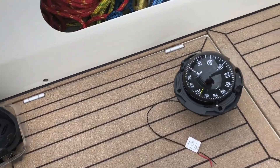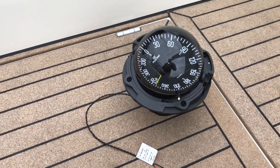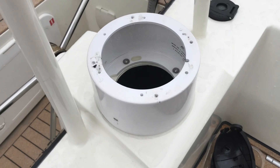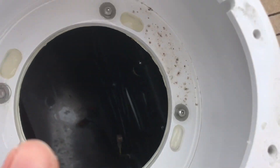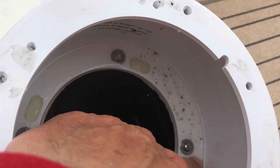I've taken the compass out because it's been a source of leaking. There are all the various bits and pieces, and here's the binnacle. Just on the inside of the binnacle here, I'll put my hand in — you can see it's all wet in here. There's water running around in there, and there's moisture underneath, which dribbles down and runs inside the steering compartment at the back.